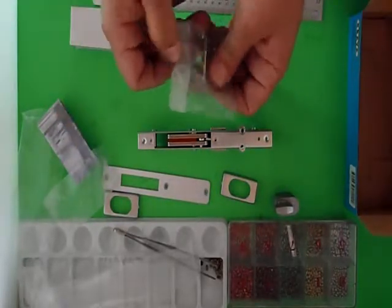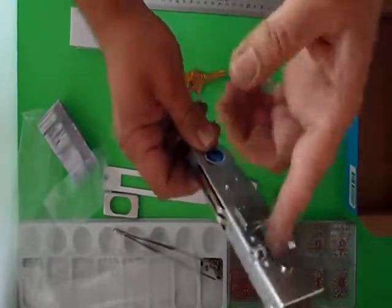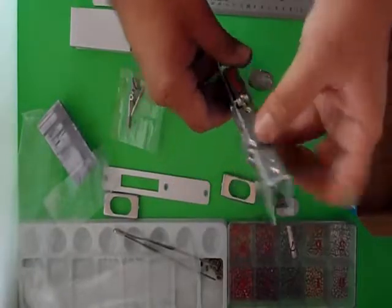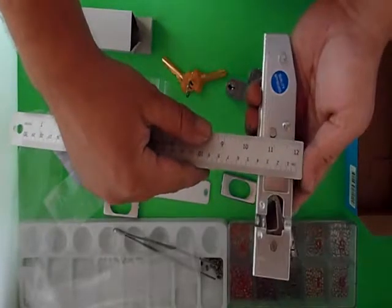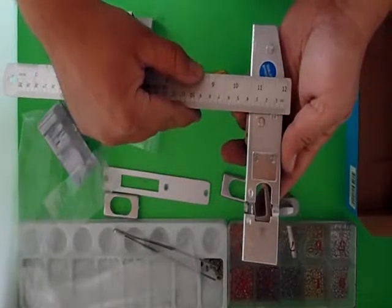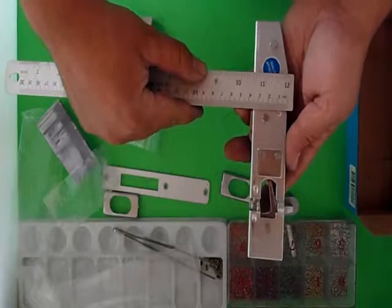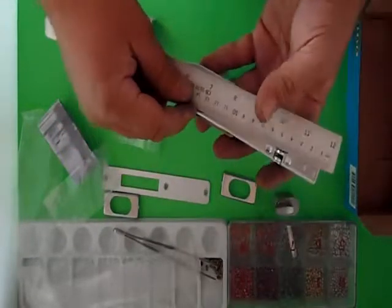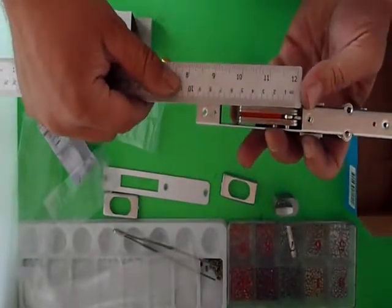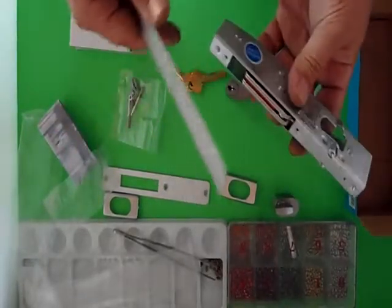First of all, you've got your lock which you would put into the door. Take note that when you do put this into the door, try and put your finger through it — you do not want to drop this inside the cavity of the door, otherwise it can be extremely hard to retrieve. The body width is about 36mm, and around where the bolt is, with the bolt protruding, probably about 38 to almost 40mm. The length is 180mm. The bolt length is about 55mm but it protrudes about 30mm.